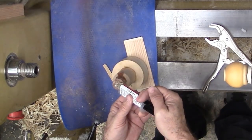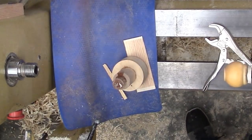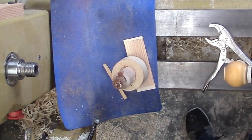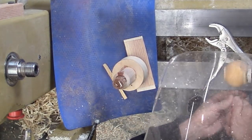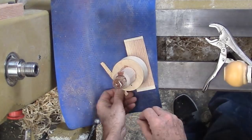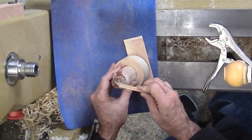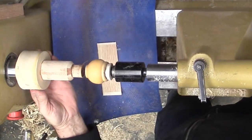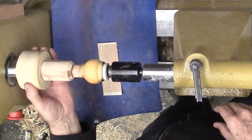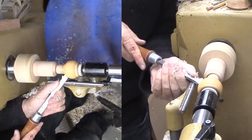After running to the store for fresh quick epoxy, I mixed up just a dab on the end of the pedestal. After a good mix, I used the tailstock to align the nut back to the pedestal. Since my shop is cold, I covered the nut with a paper towel and a heating pad — it should be hard in one hour. But don't believe the hour on the epoxy label; the nut came off and I had to do it again. This time I took it inside the warmer house overnight. Fortunately, it aligned back pretty well.